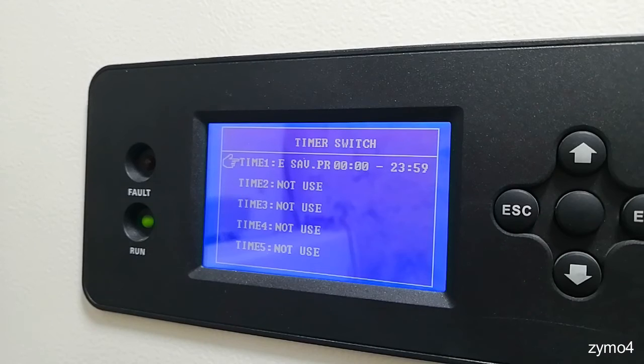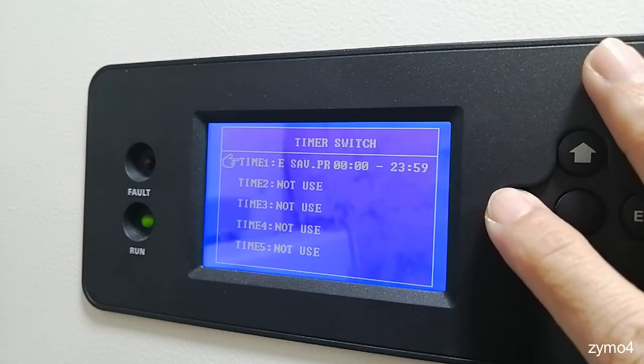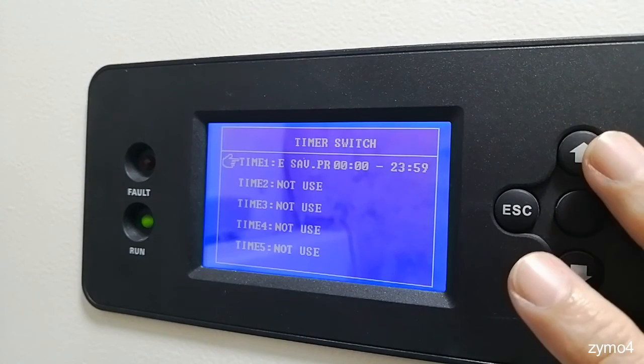e-save will instruct your inverter to do a forced AC charging, meaning it will do a bypass. In the morning it will always charge the battery first and then do grid priority — meaning all the power for your loads is being provided by your solar panels and your grid. That's the setup throughout the storm or typhoon season — right now it's typhoon season here, so this is the preparation.